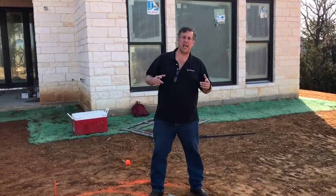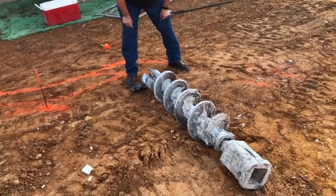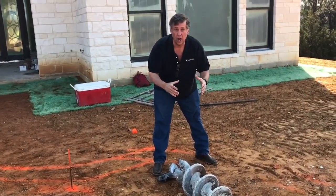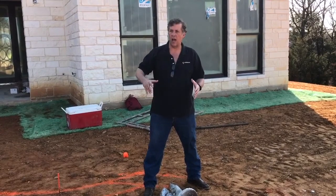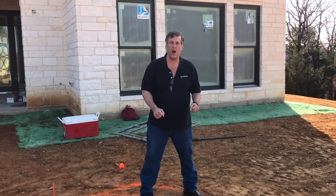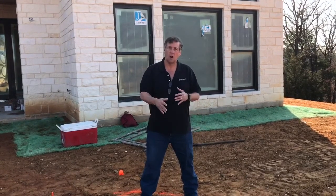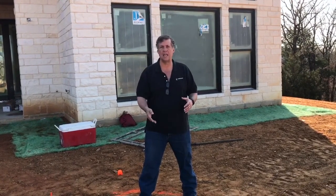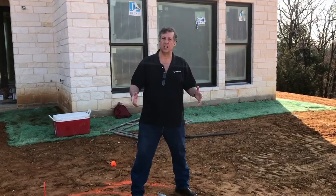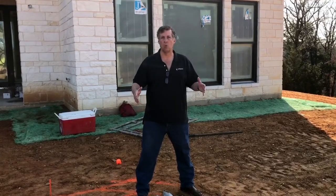One question that was just asked — which is an excellent question — are these all the same size? This is a 12-inch wide drill. The bigger it is, the more friction the pier creates, therefore the more resistance to keep it in place. Because we don't have bad soil here and we just need to drill down until we get into the original grade, a 12-inch pier works fine. Sometimes we do 18s; sometimes they have to have what's called a bell on the bottom. They're all different. The engineer comes up with the recommendations on the size and type. And when we hit water, we have to do what's called casing it, so the cost goes up dramatically. But here on this particular hillside, we're not near water, so we shouldn't have an issue.